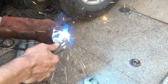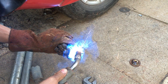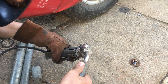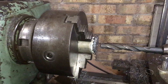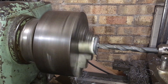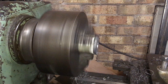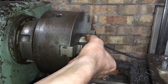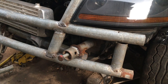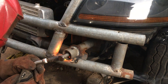Back to the mounts again — this time I'm making the half that's part of the bumper. I'm using an off-cut of scaffolding bar and some laser-cut flat washers I had left over from another project. For robustness, I'm welding around the full circumference of the tube. The washers have a small pilot hole in the middle, but if you weld it all together with dodgy alignment, the finished hole will have dodgy alignment whatever you do. For this purpose it doesn't really matter. I'm using the lathe here because it's stiffer and more powerful than my pillar drill. The next step is to bolt the two halves of the mount together and then, thus positioned, weld it all in. And there we go — truly a thing of beauty.